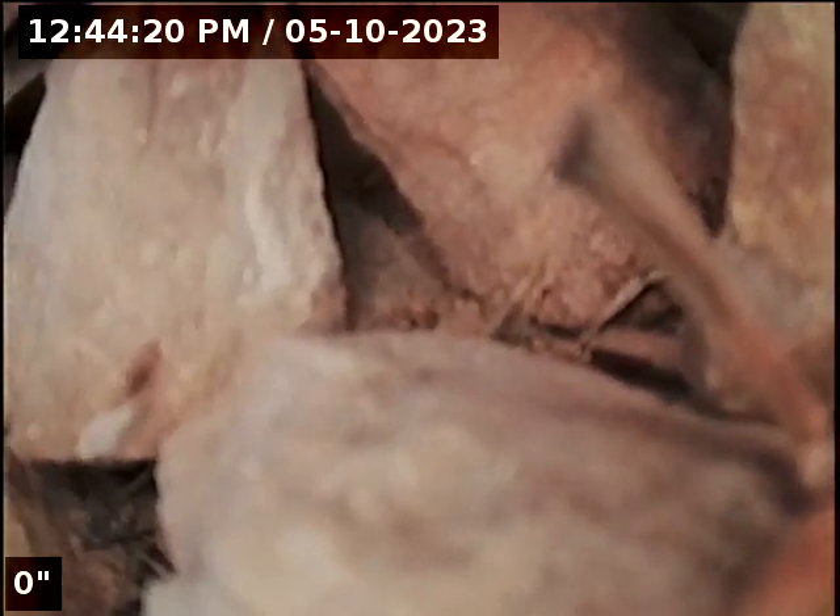Running camera at 1887 East Palm Cough Drive, Tempe, Arizona. Found two sets of mainline clean outs in the front yard. Running the west clean out first — it's a two-way three-inch ABS.